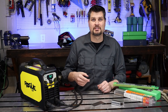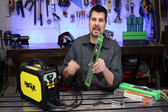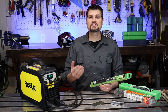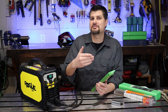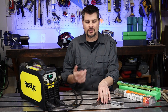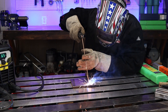The great thing about stick welding is you only have to deal with one setting: your amperage. Every pack of rods comes with suggested amperage ranges. For example, a box of 6013 3/32" rods recommends between 50 and 70 amps. Thinner material, go lower; thicker material, go higher. For a starting point on 1/8" plate, I'd probably run around 60–65 amps, see how it welds, then adjust from there.